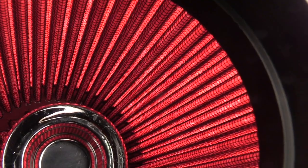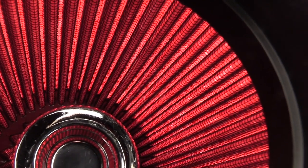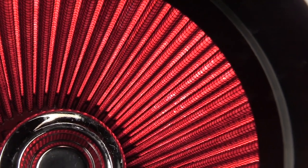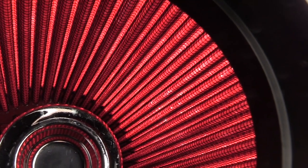I'll do it again with a Donaldson Blue filter next. But you can see right through this wet gauze filter — sunlight is coming right through it. It's not a filter you want to protect your engine. It's going to let a lot of fine dirt through to ruin it.